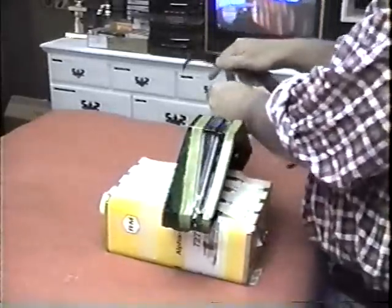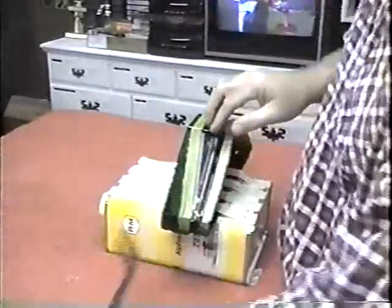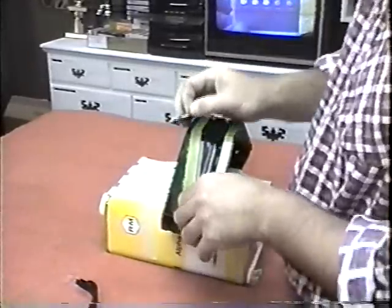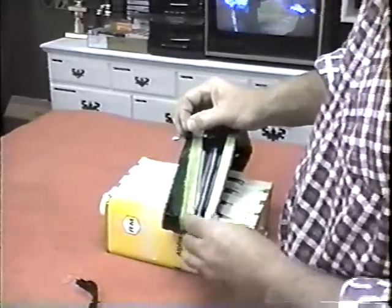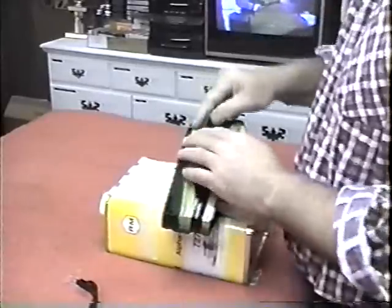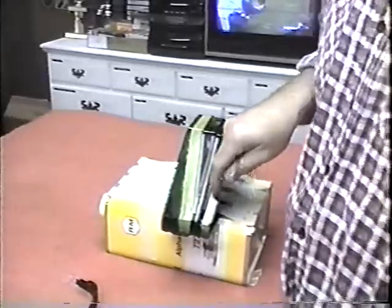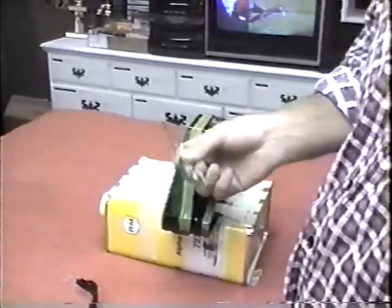The PVA comes off in sheets like this, and it imparts a really nice finish. But the problem is, you can see what's happening is it's peeling up off the mold and other little places where it's deteriorating. So what I'm going to do now is take this over to the slop sink and clean off all the old PVA, re-wax the mold, and this is a good thing to do intermittently, at least it really should be done on a regular basis. Get all this old PVA off so that my parts don't start to assume little imperfections, and any little touch-ups I need to do. But the most important thing is to get that Part-All wax on there so I get a lot nicer finish on the final part, and the PVA doesn't start creeping off the mold, which is what it's doing right now.